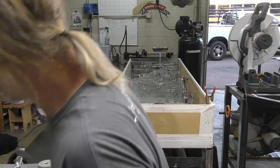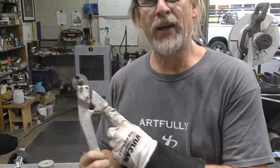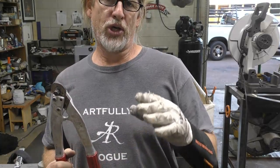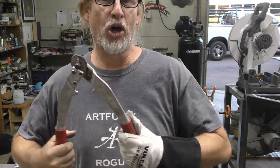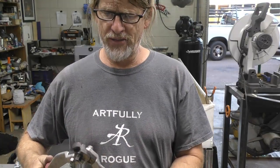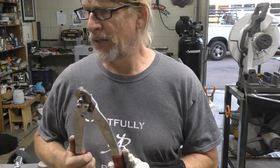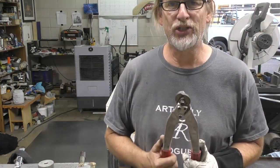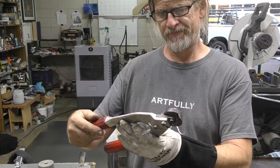What kind of cutter are you? Oh, you know what? It's a company called Felco. And when I was in the rigging industry, we used these types of cutters to cut wire rope cable. So any of the cable that hung motors and things from truss, obviously we had like a much larger pair. This is designed to cut about 1/8 inch, maybe 3/16. And I found that it is really hardy and cuts that stainless nice. And so that's kind of what I've been using. I had some hand cutters, but it just, you know, gnarled it up, and before you know it, after like 6 or 7 cuts, you really couldn't do anything with it. But these are a Swiss-made product, I've had these for years. Yeah, Felco.